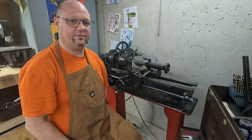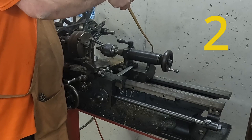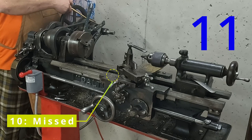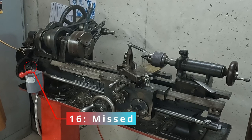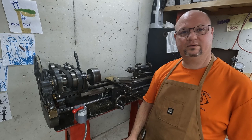There are 17 different places that this thing needs oil. What's going on is that hydraulic force causes the center shaft to float on a layer of oil between the babbitt and itself. It's pretty quiet — just the clicking of the belt; other than that, it's very quiet.